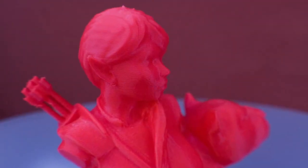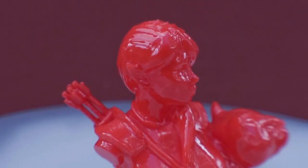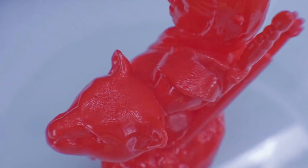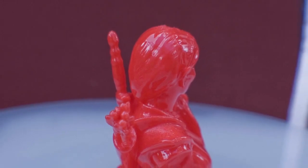Here's the model before the vapor finishing, and here's what it looks like after three hours in the chamber — incredibly smooth, like cast plastic. You can't even see any of the lines on the vertical surfaces; it doesn't even look like it was 3D printed anymore. The only weakness is the horizontal areas like the top of her head or the top of the tiger's head — they don't get the same smooth treatment and you'll still see some steps.